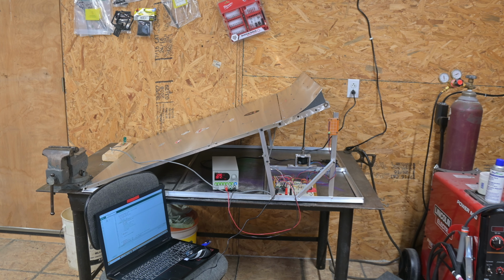And I do that just so it doesn't overshoot the home switch. And then the home switch is over there on the side, and that's the Hall effect sensor. Once that's detected, that shuts everything back down and clears the FIFO buffer in the ADXL accelerometer, and then also enables the Doppler to reread.